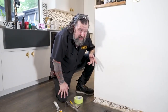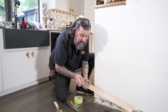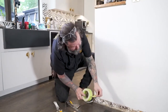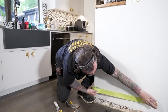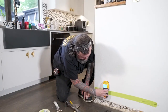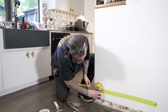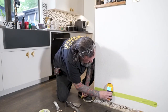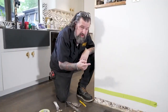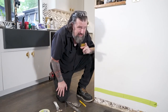The next thing is to mark out where my studs are, because I'm going to want to grab those. This molding was so small they just went across the bottom and grabbed the bottom stud. I want to know where my studs are so when I fasten it back, I know where it's going. So I don't mark up the walls, I just take a piece of tape across here, grab my stud finder, start in the middle and mark out where the studs are. There's always going to be a stud at the end of the wall, and about every 16 inches from there. Then I'll go out to the saw, cut the new pieces, and show you a trick on how to glue it together before we even fit it.